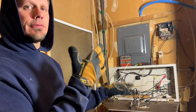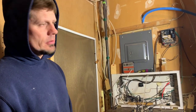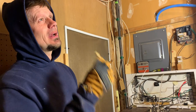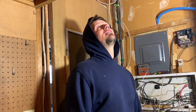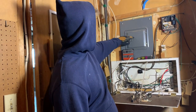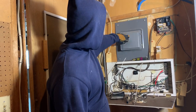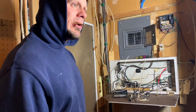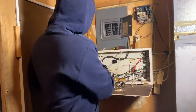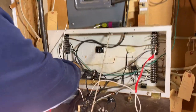I love getting into this — this is how you really learn the field. You're not going to learn this in school and you're not going to learn this pulling new wire in homes and buildings every day. I love the remodel side. When he told me over the phone what this was, I said I don't normally go that far out, but I want to see this one. When I saw it I said yeah, I love this challenge — we'll get it cleaned up, it'll take about a week. We're probably going to put in a sub panel and get some arc fault breakers installed. Don't be afraid — use your meter, check you've got 240, know your line coming in. This is all appliance work — light bulb testing, coming through and seeing where your hots came in.